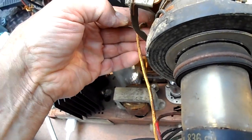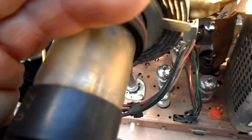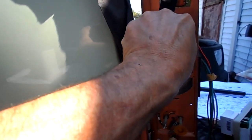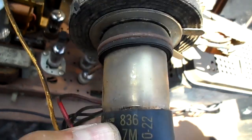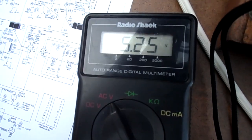This is loose. I don't like any of this. I did not test this CRT, and I do not see any picture. Let's see what the front looks like — I have nothing. The socket is loose on here. I don't see any filament. Let me check — we had it on DC, no good. AC volts — we've got 5 volts. The CRT is getting its power. That's pin 1 and 12. Next, let's check the continuity of 1 and 12.